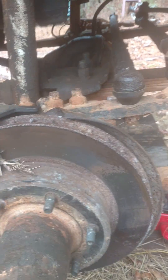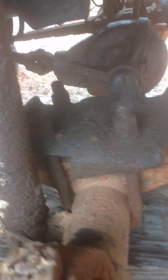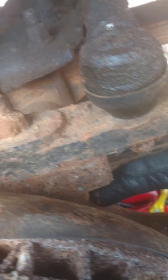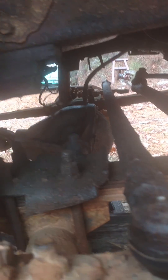This is a detailed setup on the front of my 86 Grand Wagoneer. Spring-over means originally the axle was on top of the springs — new u-bolts, everything, brake hose, steering used to go there. I sent the knuckles off to get milled, drilled and tapped, put a spacer on there with an arm stud kit. Now it gets your drag link and tie rod up above the springs and out of the way, keeping them horizontal. If you still ran crossover steering with a spring-over, your steering would start down here and have to travel up. You can run a drop pitman arm to get it horizontal, but the results usually aren't as good as this setup.